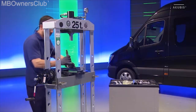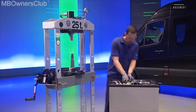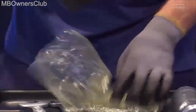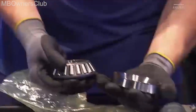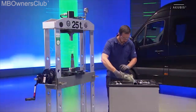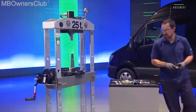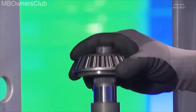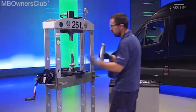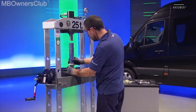You need a press for the next step because now the ball roller bearing is pressed onto the bevel gear wheel. Remember that you must never add additional grease or lubrication to the lubrication already on the new bearing. The new bearing is then placed on the bevel gear wheel. Then fit a sleeve. Now you can carefully press the bearing onto the bevel gear wheel.